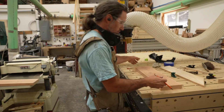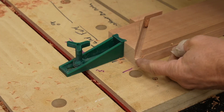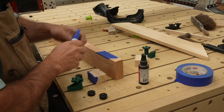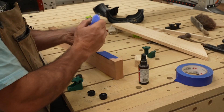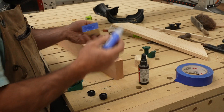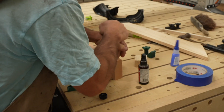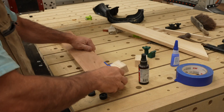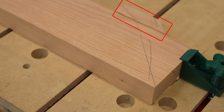Now onto the CNC machine. I did some initial test pieces in pine, and I realized I was getting a lot of chip-out wherever the bit would leave the wood perpendicularly from the grain. I asked on some of the Avid CNC groups on Facebook and people gave me suggestions. The thing that worked best was to support where the bit was going to leave the piece of wood. I would mark that location and glue on a little extra piece. My first test I used blue tape and CA glue, but later I just started directly gluing a little scrap piece to the edge, and that worked fine to prevent that chip-out.